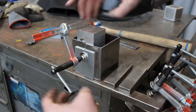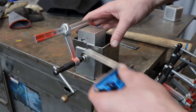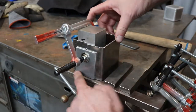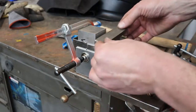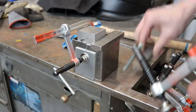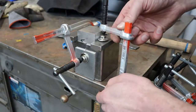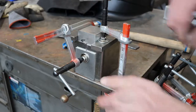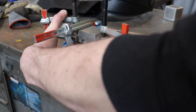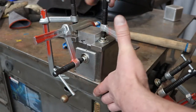I've got a big aluminum block here as a fixturing block and heat sink, as well as a smaller one to help align those two surfaces together. I'll check the top surface and you can see it's not quite sitting right — that's going to be typical of a few pieces right off the bender. Here's one method for getting it clamped good and true: take a couple pieces of square or rectangular stock, and I find these F-style clamps work pretty well, putting one on either side to hold the part down so those two edges line up better.